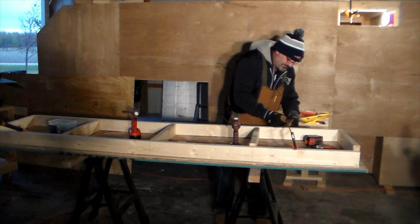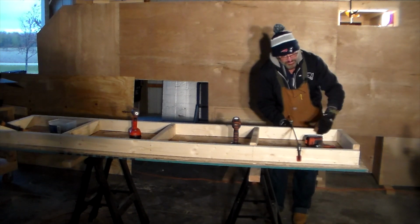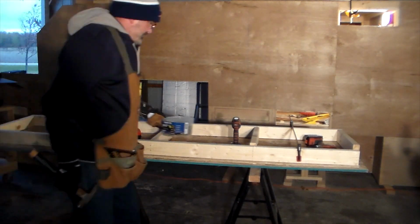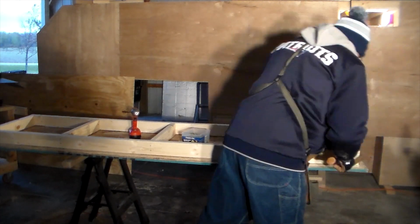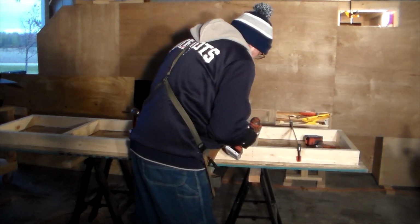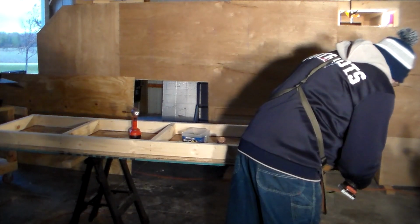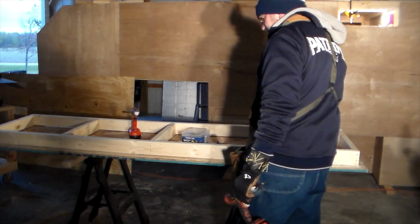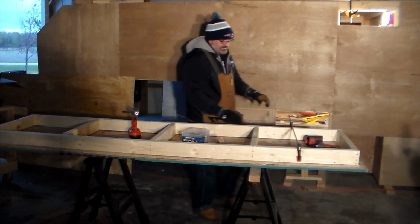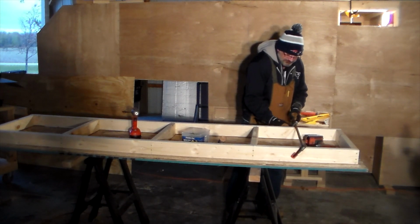If you look down the length of the 2x4, you can see that it's got a crazy warp in it. So how do we get those out? I've shown you this before in my videos. All you do is take your wood clamp and pinch the wood, and then you saw me use the hammer to knock everything so that it's flush and even. And I already drilled my holes, so now I just gotta put the screws in, and there you go. You take the clamp off, you're all done. Too easy, right?